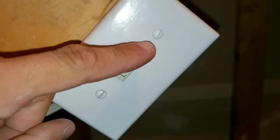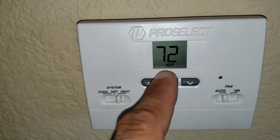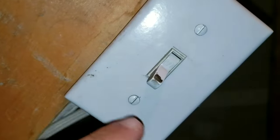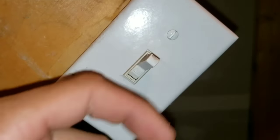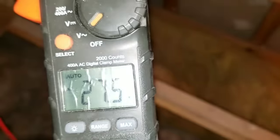I'm going to turn my switch off. This is going to be my power supply to my furnace board — the 120 volts. Now I'm going to set my thermostat to heat and auto. 72 degrees is the ambient temperature; you can see my thermostat clicked — it's calling for heat. Just make sure your temperature is set higher; we have it set to 76. Now we're going to turn our switch on, which gives us the 120-volt power supply to our furnace board. I'm going to take our reading — again, one lead grounded on my multimeter. I should have 24 volts coming to my W terminal, and you can see I do have 24 volts.